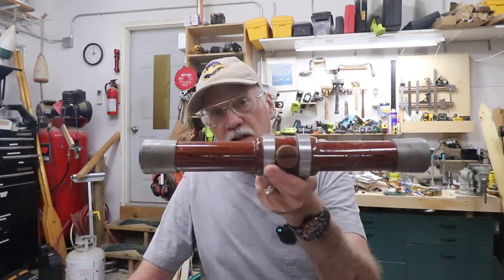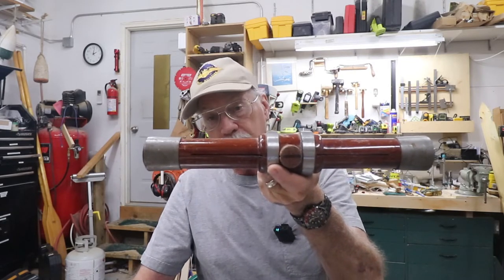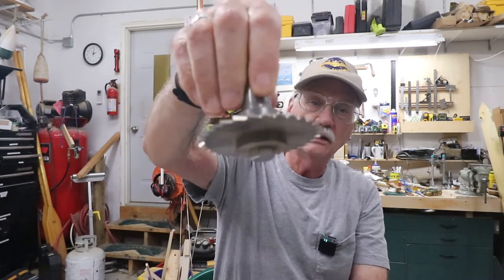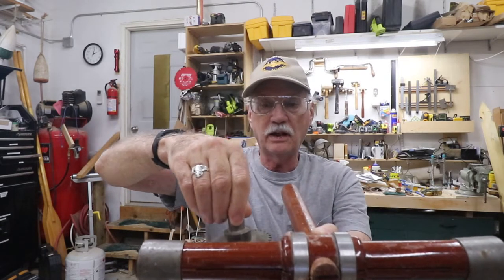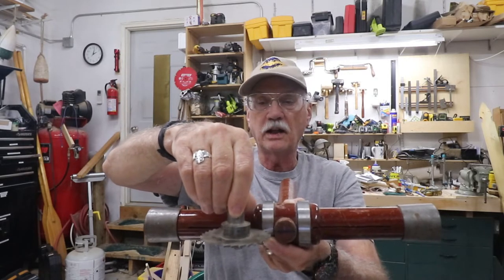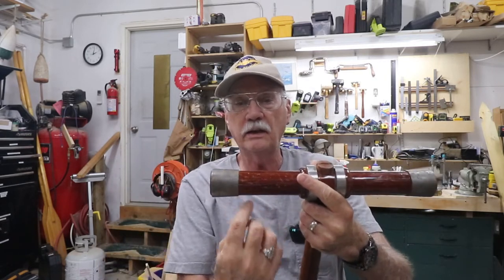As to improving the slots, I had access to a machine shop. After the rings were in place, I would chuck this up, with the grain going the right way, into the vise on the milling machine, and I have a slitting saw, and I cut this side of the slot, and then pick it up, move it over, come back down, cut this side of the slot. Actually, no, I cut this side of the slot, move it over like this, and cut this side of the slot so they all lined up. Of course, that would leave a semicircle here on the inside, from the radius of the saw. And then I went in with the keyhole saw again and just cleaned that part out.